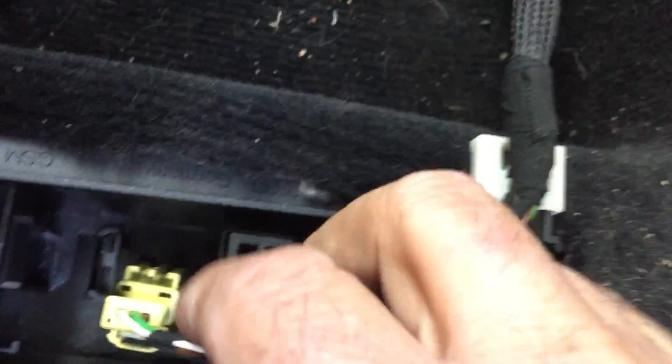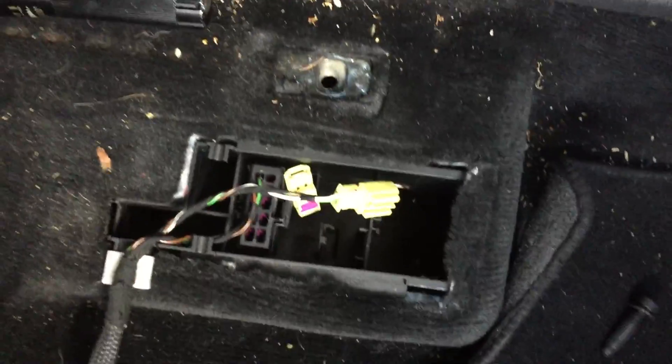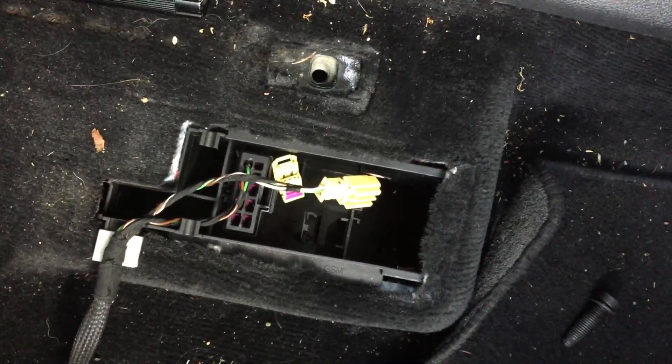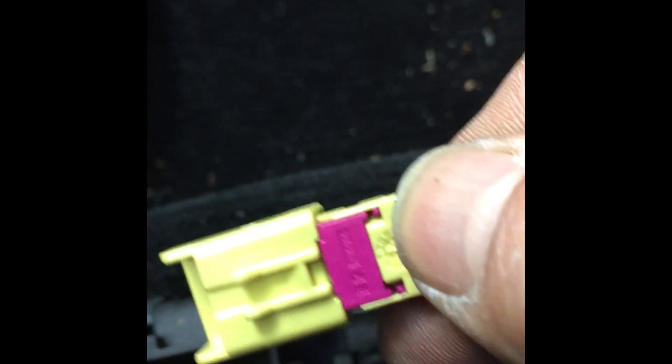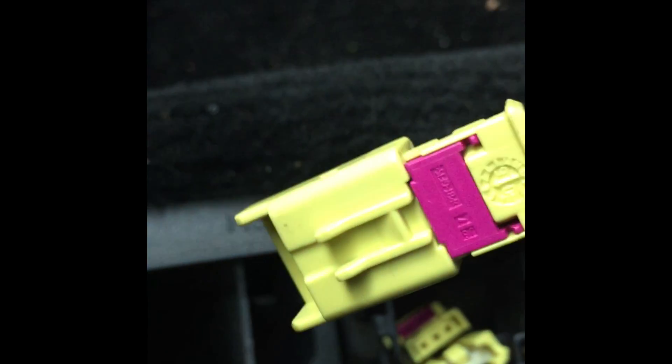There we are. This is one of the connectors and it was okay. This last connector is the one I expected to be faulty, so I will test it and see if any wires are not contacting. I checked the first connector and it was a bit loose, so I'll check this one first just in case, because I didn't like the way it looks. I'm going to test this connector with the pin. The purple plastic piece comes off to expose the bare wires so you can test them, then check the two connections for continuity in all the wires.